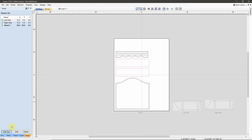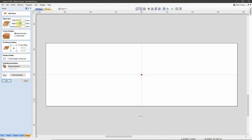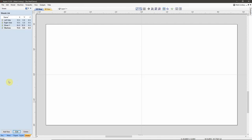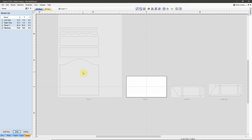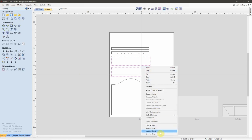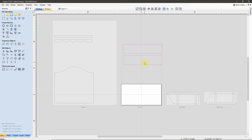I'll come down here and create a new sheet. We'll call this Shelves. Then I'll select the name again, click Edit, and we'll go 15 by 8. Thickness is still half inch. I'm not going to change anything else. I'll zoom back out, double-click into Sheet 1, select those two vectors, right-click, Move to Sheet, Shelves. Double-click my Shelves sheet, select these — I do not need to rotate them at all — hit F9. Now my shelves are placed on their own sheet.